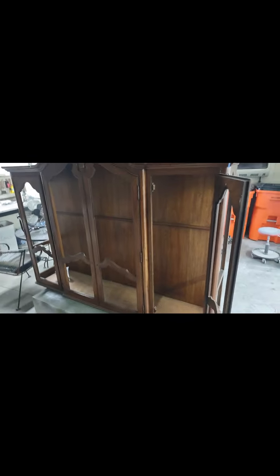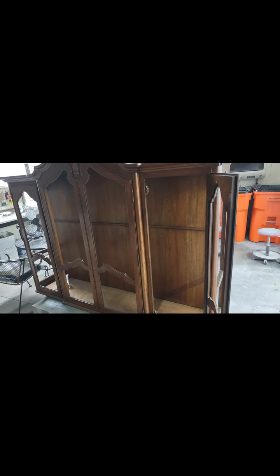Here is the hutch cabinet. I took all of the chicken wire out — it was stapled in — and it is a beautiful color that matches the hinges here, this bronze color. It's going to look really nice with the Tell Me a Secret white, because we're going to leave this wood back here original — it is beautiful with all the different wood tones, golds and browns, just like the tops I redid. Right now I'm going to get all these twelve hinges taped off. I'm going to open up the doors because I'm going to paint the back and front of the doors and everything in between. There's glass on the sides that is not removable — it looks like they glued it in. On the outside I started taping that to get it taped off and covered. I'll then be able to prime it. I probably have a good solid one to two hours of prep, and then I'll be able to prime this.